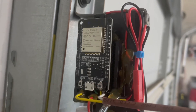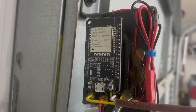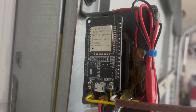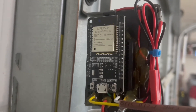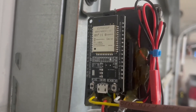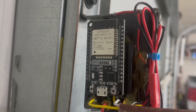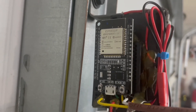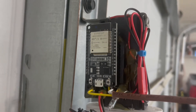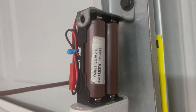Not all the time will the unit be in standby — it will get triggered periodically and use double the current. Assuming 5% of the time it gets triggered, the calculation works out to about 90 days of battery life. So every three months, you need to safely recharge the battery.